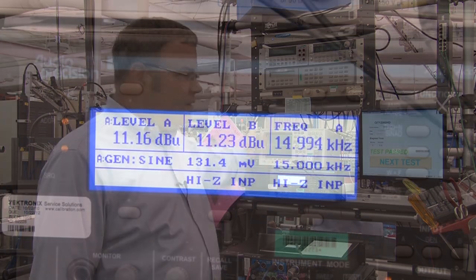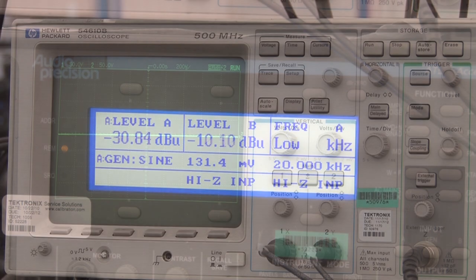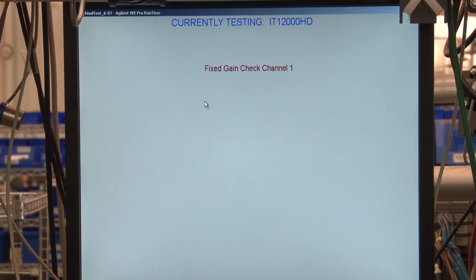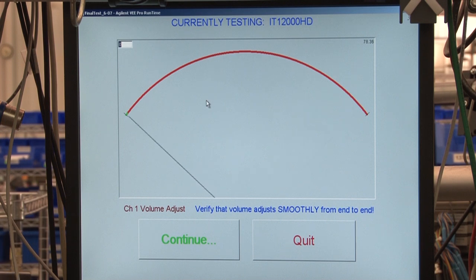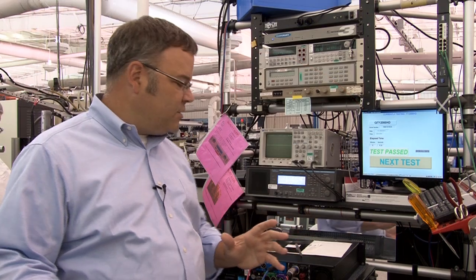We've got some fairly straightforward audio measurement equipment here and we're going to run this amp through a huge battery of tests: THD, crosstalk, IM distortion, output noise, output power at 8, 4, and 2 ohms. We're going to drive this thing into a direct short circuit. We're going to run it into some extreme and unusual loading conditions — all to make sure that this amp can survive absolutely anything that you'll connect it to.